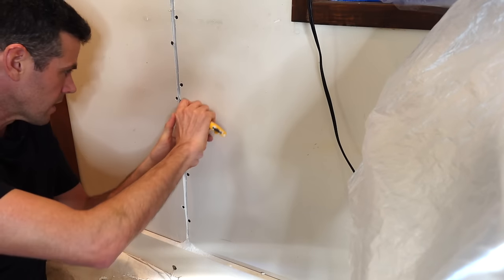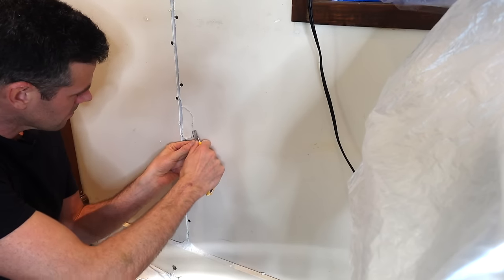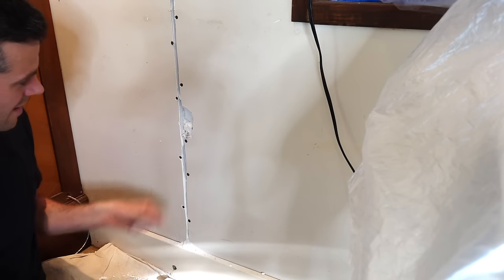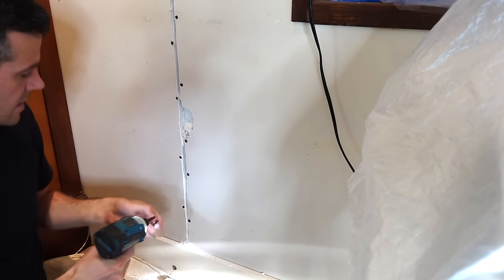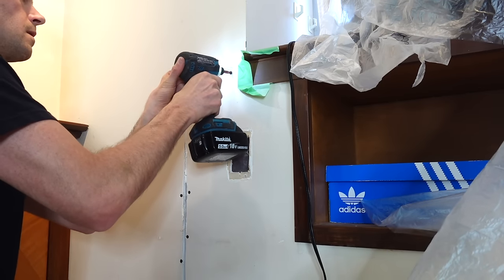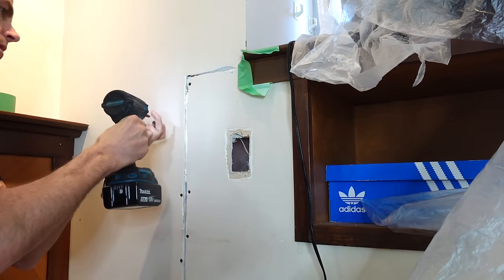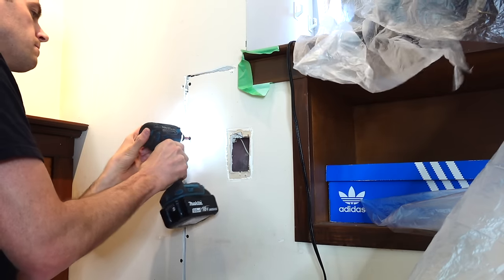You've also got to look for blown-out spots — like here we have a nice big blown-out spot. You want to fix all the damaged board. This was actually held in by nails. I'm gonna use a drill bit and a hammer to sink that nail a little bit under the surface so it doesn't cause me grief. That's what happens when you hit nails too hard — nails kind of suck anyways, but definitely if you don't know how to install them. There's a whole lot of air over here so we're not gonna fasten this one because there's nothing there, but that is now ready.